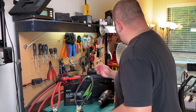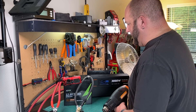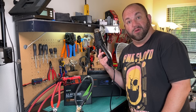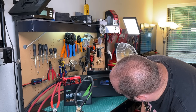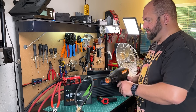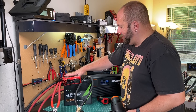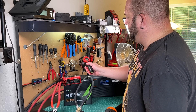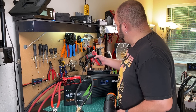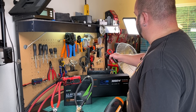Now let's test battery two. Turning the breaker on and the inverter on. Going straight to high power with the heat gun to check that it can handle the 120-amp load, then we'll crank it up — really just checking for consistency and quality control. We're at about 119–120.5 amps, 1,330–1,340 watts. After about three minutes at roughly 122 amps, it handled it no problem. There's a tiny bit of warming on the top of the battery — about 88–92 degrees. Battery one is showing about 109 degrees, cooling down from when we pushed almost 300 amps through it.